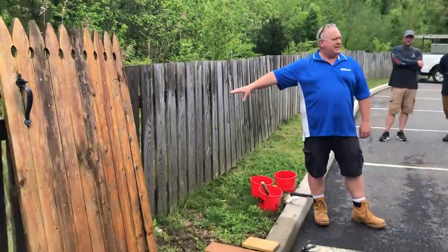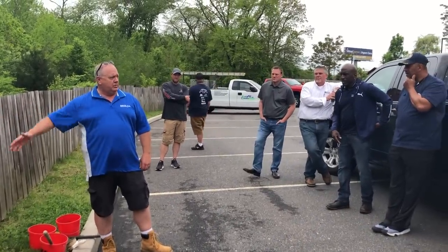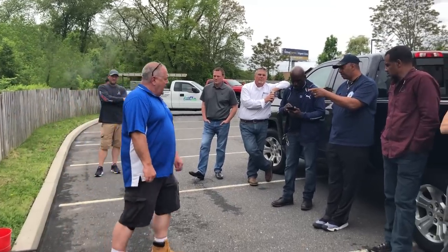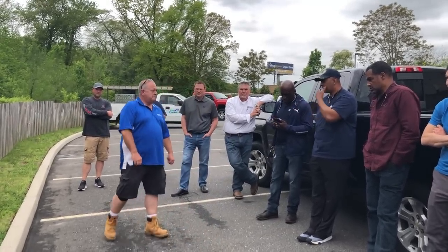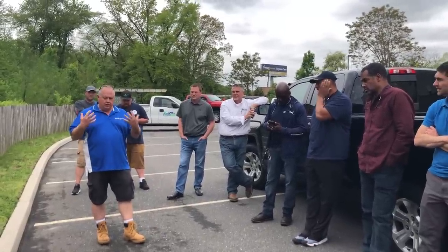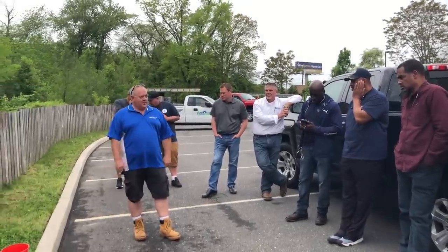What happens is you'll go back to that fence or that deck in six months or a year and it'll be blotchy, because some of those gray wood fibers will come away from the wood. So you're saying even on this, use the same thing, sodium metasilicate, on wood that's unstained? Yes, you could, straight up. You're trying to get that nice, real rich wood tone. You want to hold on to that. Sodium hypochlorite's a little harsh, a little hard to do that with.